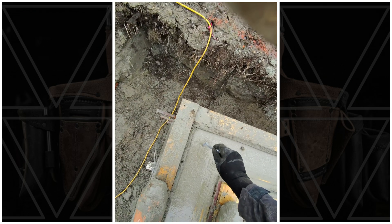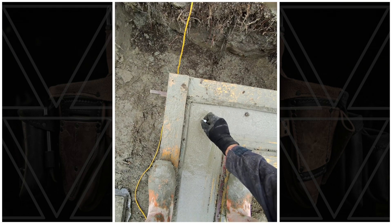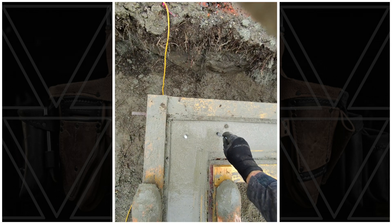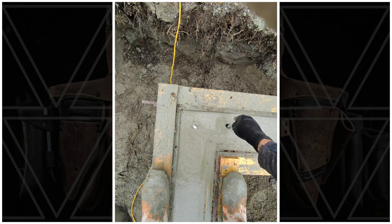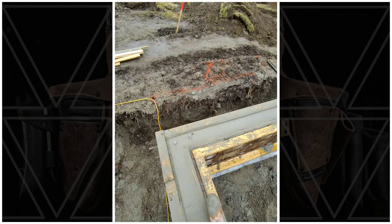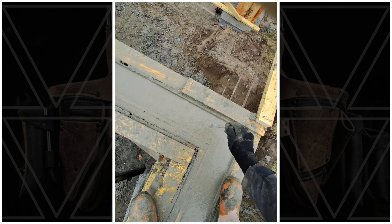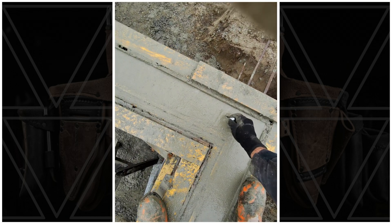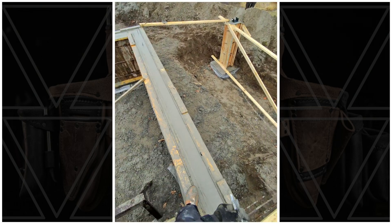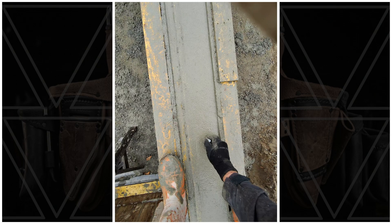Putting in anchor bolts — I like to set them up so the corners get done really nice. I'm going to put one there to catch the plate coming this way, and then another one just back of it to catch the plate coming from the other direction, so I don't have to add any concrete fasteners at that end of the plate. Also want to make sure we don't put any anchor bolts where there's going to be a post to catch a beam. And on top of that, I'm going to make sure we don't put any bolts where we have doors — we've got the slider door here and this is finished floor height — so stay out of the doorway so we don't have to grind off any bolts later.